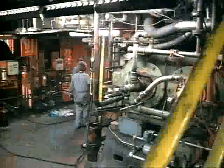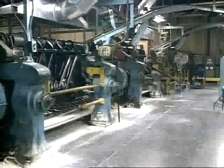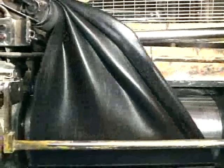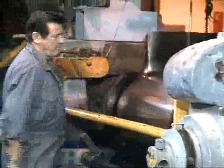The raw ingredients are mixed in batches in a huge mixer called a Banbury mixer. From the Banbury, the different rubbers go to different locations throughout the plant. At this stage, all of the rubbers are very soft and sticky — there's an overpowering urge to grab some and chew on it. This is a cracker mill. The cracker mills squeeze air out of the rubber and allow it to go around and around until it's completely uniform and ready for processing. Trimmed-off bits of rubber are blended back into the mill.